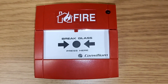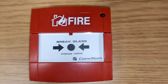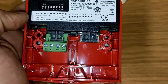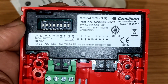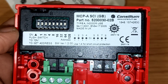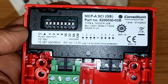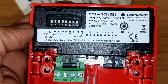Now we will look at the manual call point of the fire sensor. This is the manual call point, and we set its address the same way as before — eight DIP switches are provided, all currently in the off position. Whichever address you want to select, for example address 5, you need to switch on DIP switch number 1 and DIP switch number 3, so one plus four equals five.